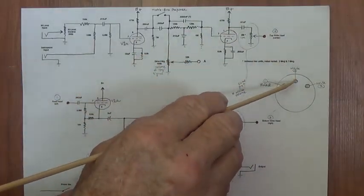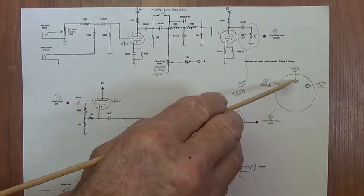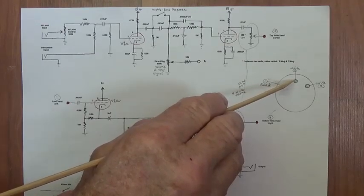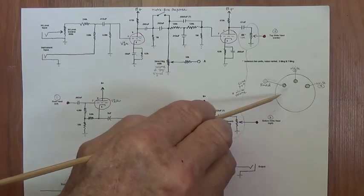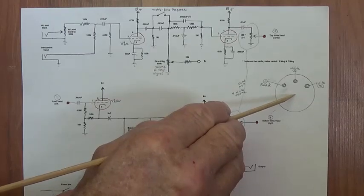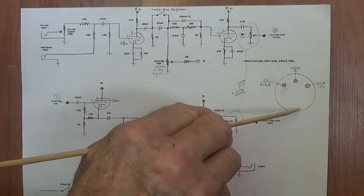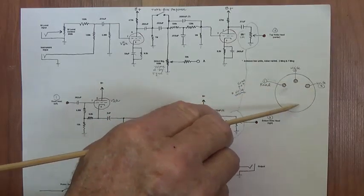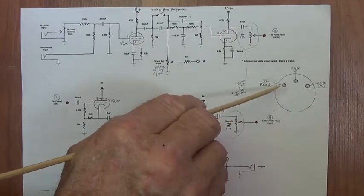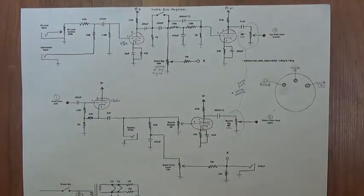Now, the method of writing is not the type of magnetic storage that we're accustomed to on the ferromagnetic reel-to-reel tape or videotape. Instead, it's stored as an electrostatic signal in the little tiny carbon granules that are present on the surface of the anodized aluminum disc. This electrostatic message will then continue around on the spinning disc to be picked up by the read head. And it should be noted that it is picked up more than once, because each time the disc spins, some of the message will be picked up until the message itself finally dissipates from the surface of the disc.